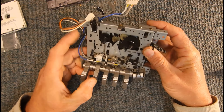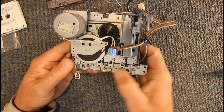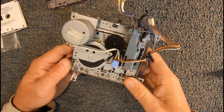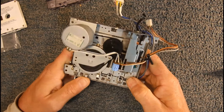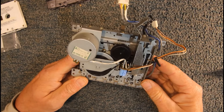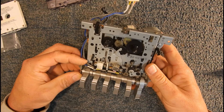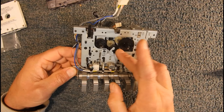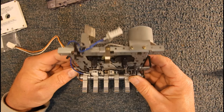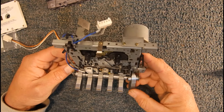Some of these earlier decks are much simpler — you can see everything. The whole play part is on the front, it all slides up and down in one unit. On the back there's very little — just a few bits that slide up and down and a latching plate that locks each button in. When you press stop, that slides back and everything falls into place. So these are quite easy to work on if you ever need to fix the mechanics, though generally they're very reliable.